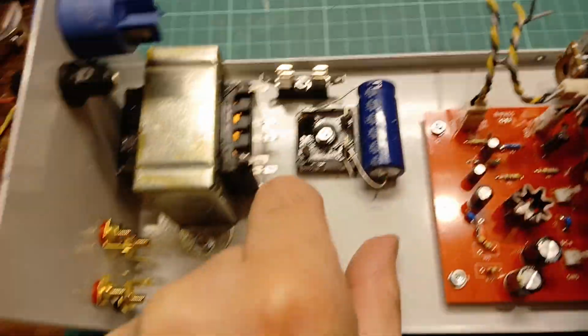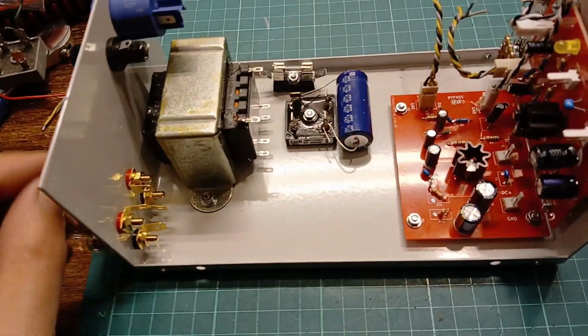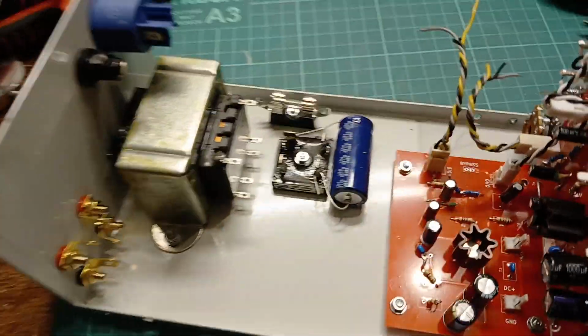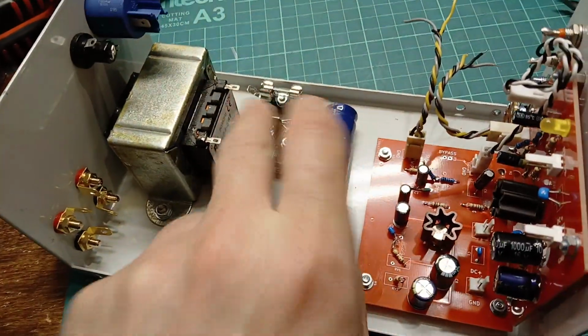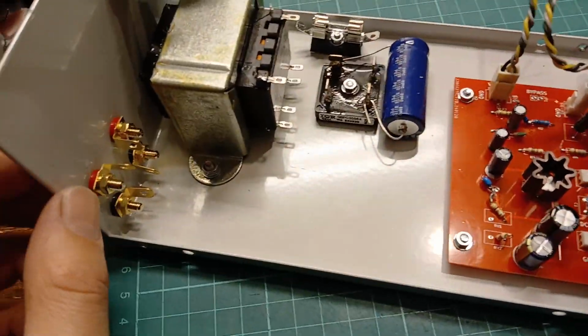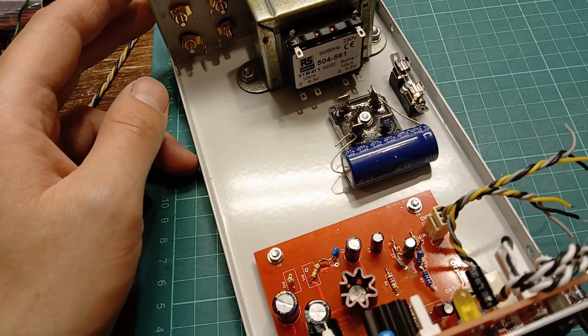If this one will go in there, then I'll have to put a little regulator board in here to drop the voltage down, because that's too high a voltage. We'll see how we get on. I'm not even going to bother connecting both secondaries up. There's just no need to. It's not even going to draw the 10 VA from one secondary, so that can just sit there doing nothing. Well, I might connect it just for the sake of completeness.